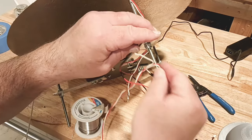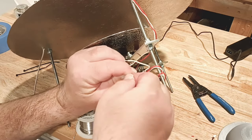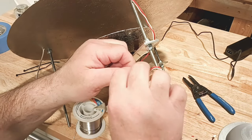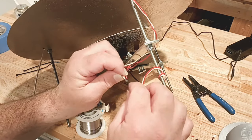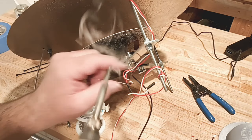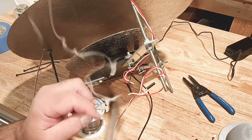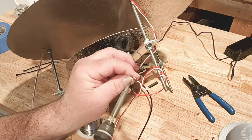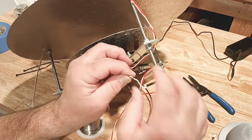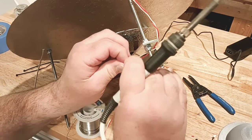Make sure you wire the other side keeping the same theme — red is to red always, and then whatever color you've got left is hooked to the other one. Pretty simple, pretty easy. This way you don't need a wiring schematic — it's one-to-one wiring here. Just solder that on there and we'll shrink that up. Hook those two together, it makes it easier. Put the solder on there, get it lined up. Try not to leave any sharp points on it. Pull it, make sure it's good. Shrink tube it and we're good to go. This part is done — we now have all of our motor wires connected and they're ready to be run out.